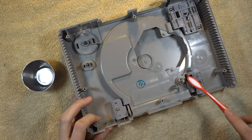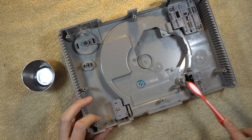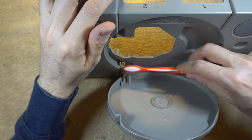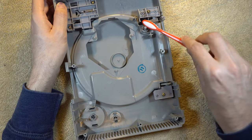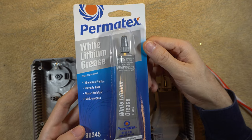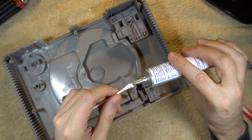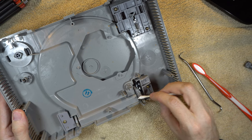I'm using a toothbrush and a Q-tip with isopropyl alcohol to clean off the old grease. I had to clean some of the teeth on the gears, then move the gears forward a little and clean some more. I'll be using white lithium grease — a highly recommended product for this kind of work — and I'm applying it to the gears.